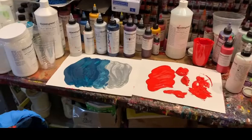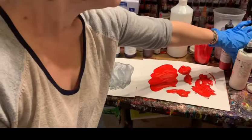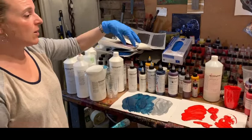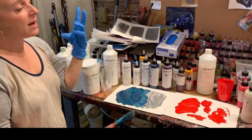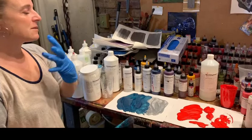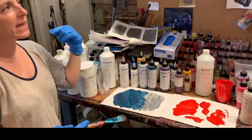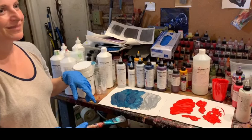It has a smell to it — I always recommend ventilation in the studio. Gloves, ventilation, and if you're using large batches — we sell buckets of resin — I like to wear a respirator mask. You want to use a dust mask, an N95, if you're working with dry powders. But the dust mask does not help you with fumes — you need a respirator mask, like a spray painter's mask, with an organic vapor cartridge. Just wash your hands immediately if you get any on you.